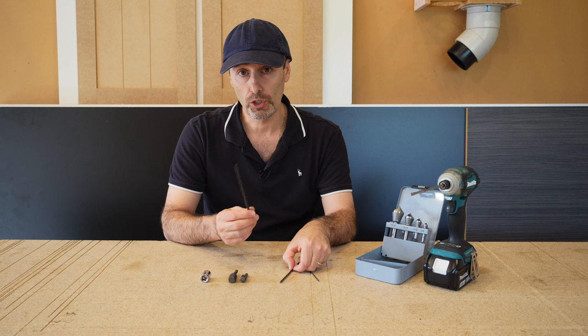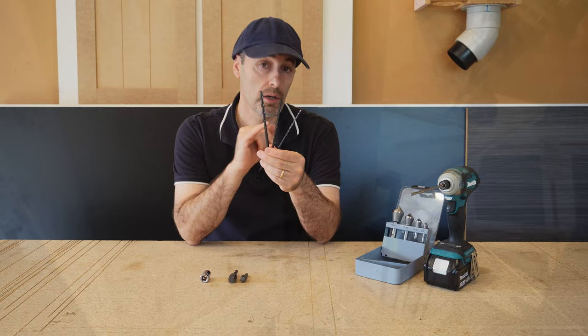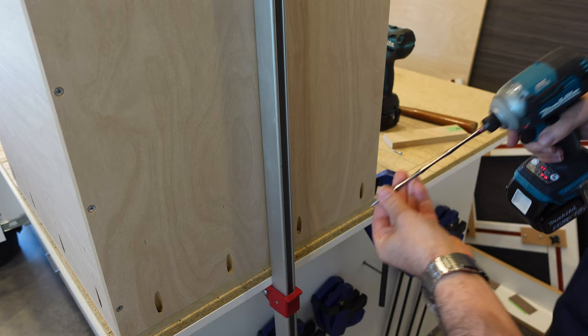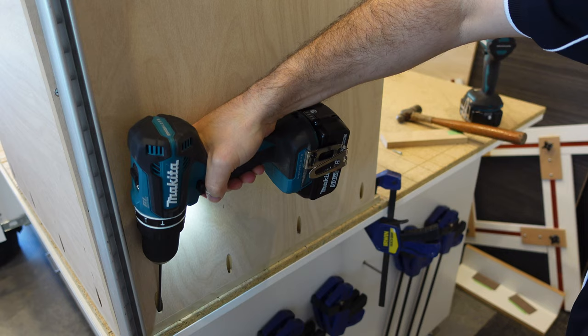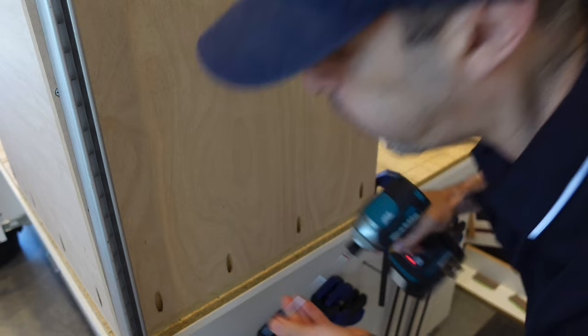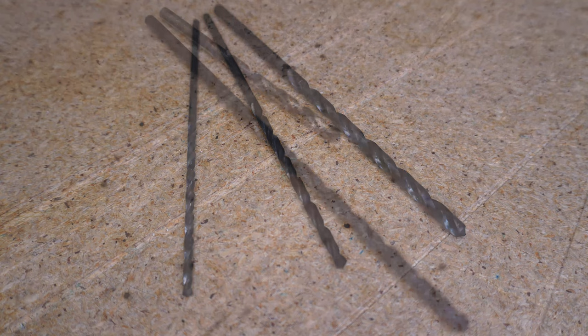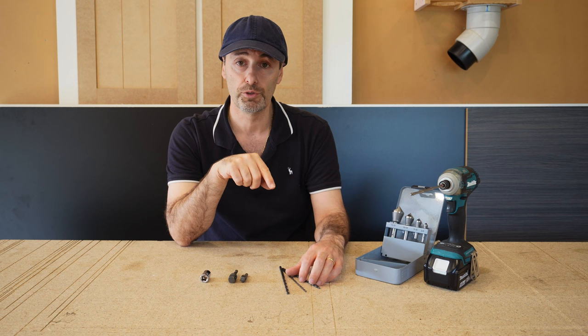I also want to share these long series drill bits. I find these really handy when I'm using my pocket hole jig, because of the sharp angle on the jig — you just can't get your battery drill with a normal short drill bit in there. If you wanted to do a pilot hole, especially when working with MDF which can split very easily, I like to pre-drill a pilot hole in my pocket hole too. These long series drill bits let you reach in at that angle to give it a little start before putting your screw in. I really recommend getting a couple of different sizes, especially for pilot holes for your chipboard screw — it'll keep you out of trouble splitting your MDF.